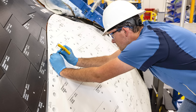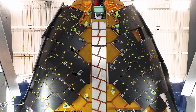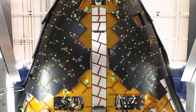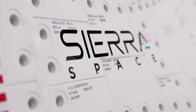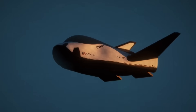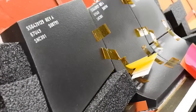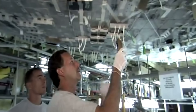Recent updated images highlight the progress and complexity of this process. Because of the unique shape and rounded body of Dream Chaser, each tile needs to be a perfect fit and contour the body of the space plane. Close-ups highlight that there is practically no space between each tile. This is very important, as it only takes one tile failure or improper gap to risk the entire vehicle during re-entry. On average, Dream Chaser tiles are around 10 inches by 10 inches, which reduces the number of tiles in total and simplifies the installation process.